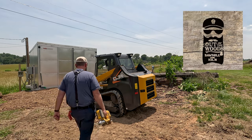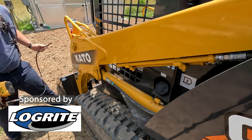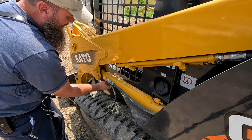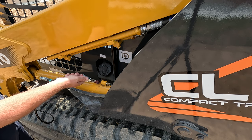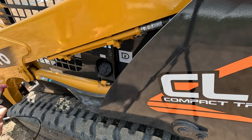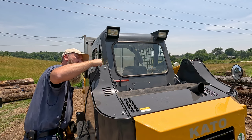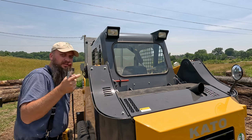Let's put some grease in the track loader before we get started. For you guys out there that run track loaders on a daily basis, how often are you putting grease in the loading arms here? The manual on this one suggests, I believe it says, every 8 hours or daily. Since I'm not running mine 8 hours a day most of the time, I'm just doing it every 8 hours. But I'd be interested to hear what a lot of you experienced operators out there are doing on your machines. Leave me a comment below.